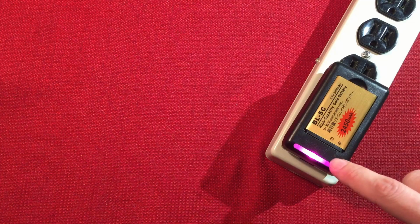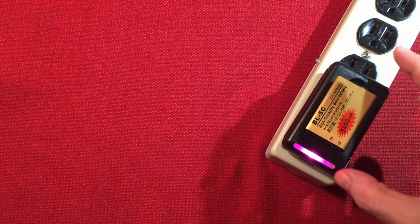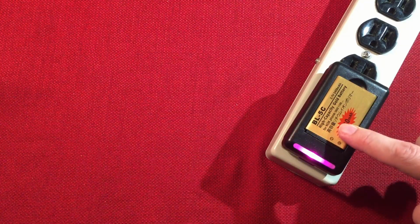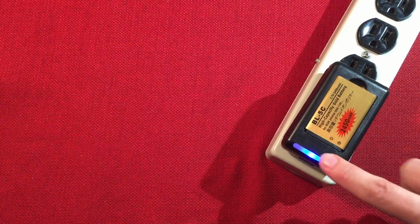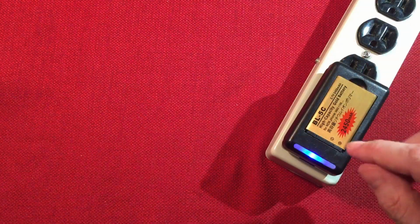There's what they call saturation charge on the lithium ion. As it goes through, I think the better camera chargers for the camera batteries do a better job at doing the peaking and then the saturation charge. Saturation charge actually lowers the amount of amperage going to the battery. As the voltage lowers, it lowers the amperage going to the battery, and it does a saturation charge to bring the battery up to full 100%. As you see, it says it's already peaked because it's already at high voltage. So this battery is already charged. So that's great, just so you know the difference between peak chargers and peak and saturation chargers.